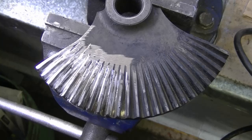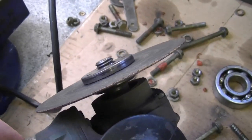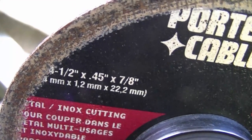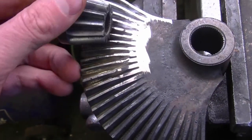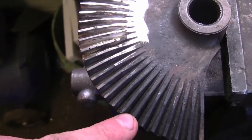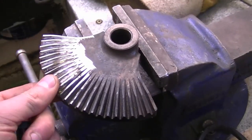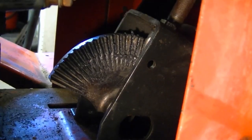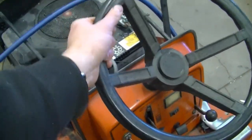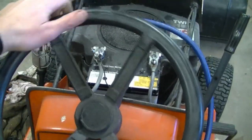I'm done welding and grinding it. It's not perfect but it's going to do. I used a thin cutting disc — 0.45 thickness — and I tried the gear and it seems to work pretty good, works as well on the old teeth as the new ones. I've put it back in the tractor and also put new bushings on the gear sector shaft. Even though the teeth are homemade, the steering is much better — it doesn't slip, and I put a lot of grease on the gears.